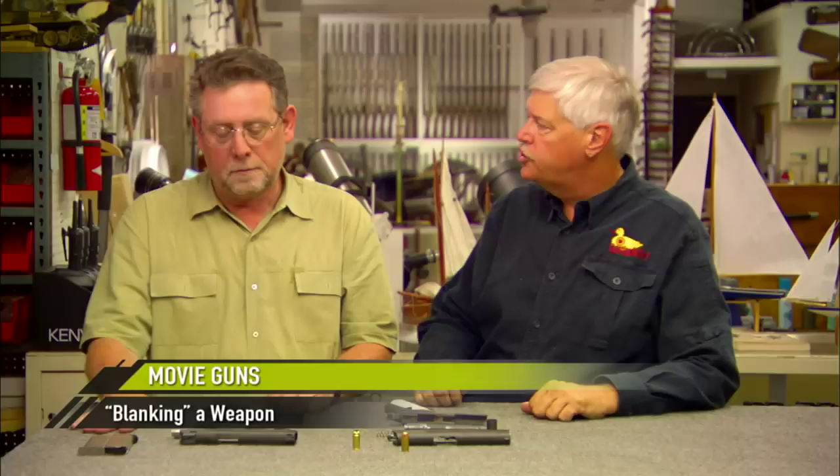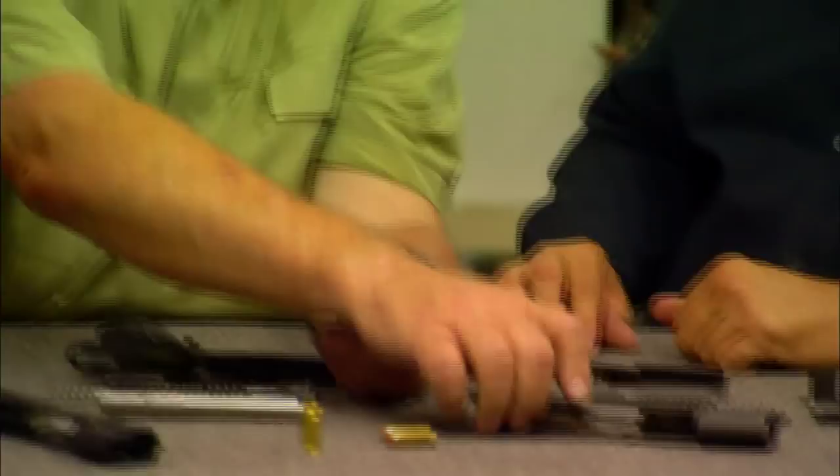What we have here are two 1911s — a new Sig Sauer and an old Springfield. The difference is one of these guns has been changed over to only operate with blanks. To modify a 1911 for blanks, you really have to junk the gun out. The problem is there's no projectile to produce recoil, which is how these guns operate. When you lose that, you have to turn them into a blowback-type weapon, which means you have to defeat the locking system. This style weapon has a very complicated locking system, so it's just as complicated to defeat — it takes quite a lot of work.